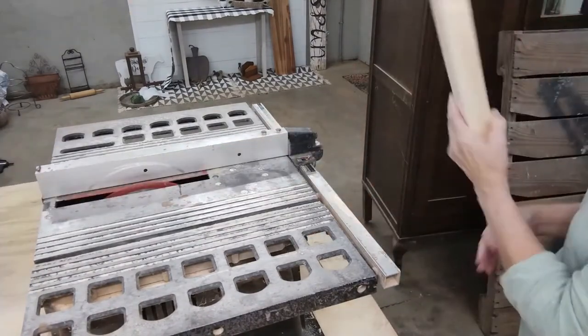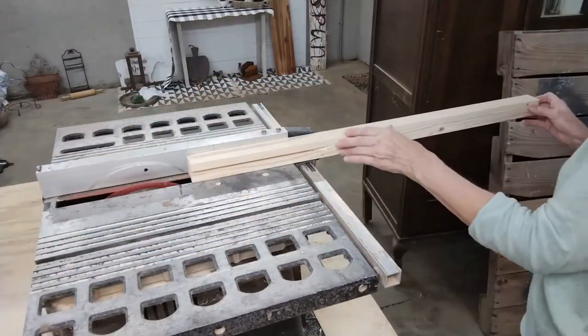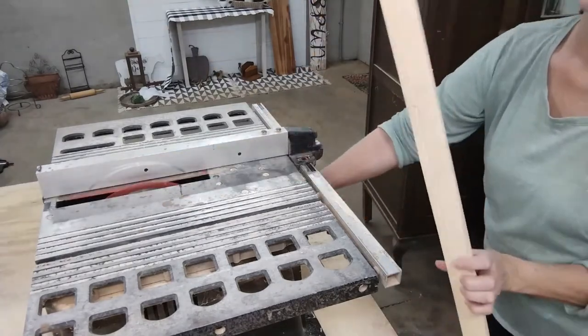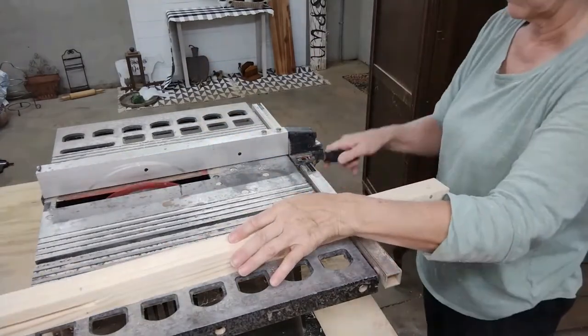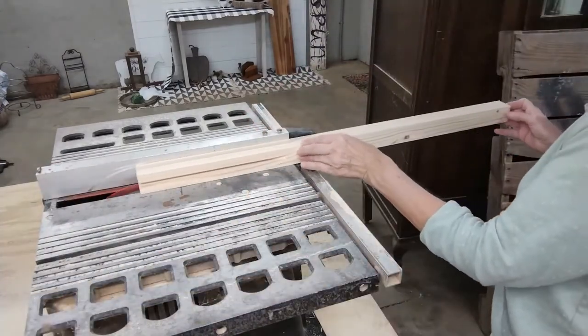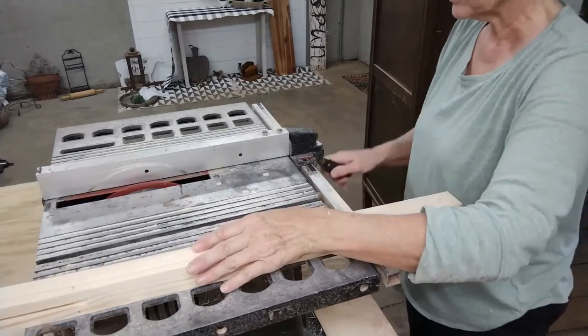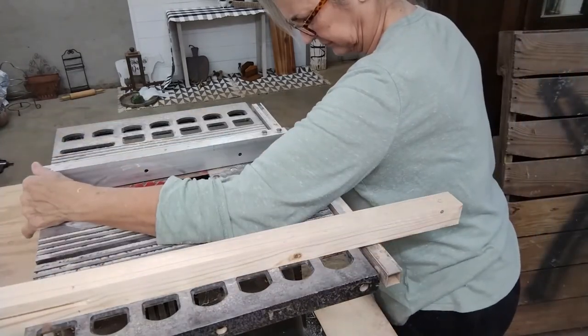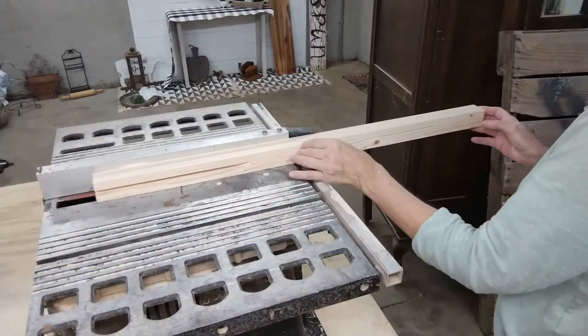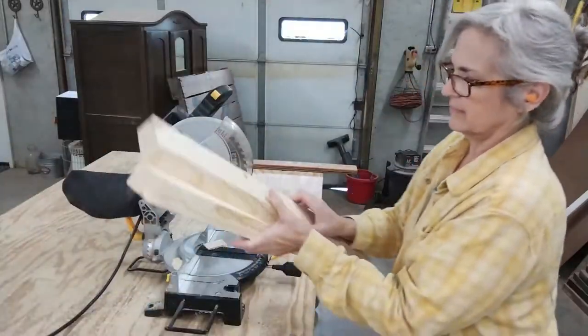And you see, I had to make a mark on the table saw, and then I made a mark on each leg. And the cedar was thicker than one blade pass. So for every single slot, which was 2 slots on each leg, I had to run it through 5 times. So it took a minute, but it ended up working really nicely.